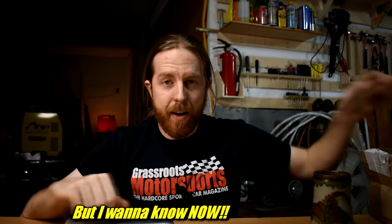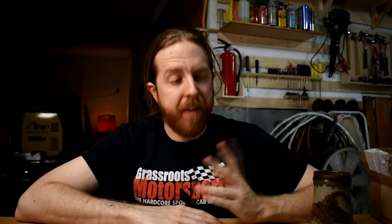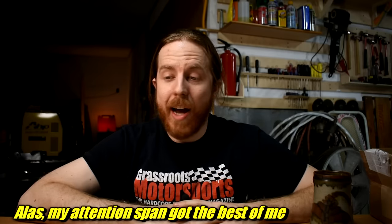I have a pile of Zamak over here, and it happens to be Zamak 12, ZA-12. Supposedly number 12 is the good stuff for gravity-fed sand casting, which is what I do. I am about to embark on a huge project that I've started and failed before, and it starts with a gigantic casting. I've never used Zamak 12 before, so I'm going to do a little experiment today. I've got some stuff here in plastic that I really like in metal. We're going to cast it and try to extract a whole bunch of information out of the castings — try to see how zinc works, and maybe you can get off on the right foot if you ever try to use this stuff.